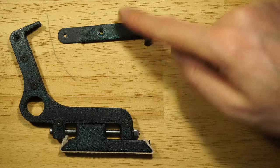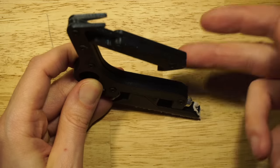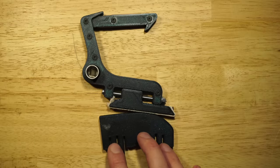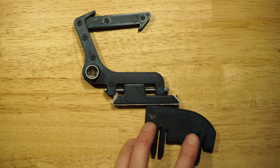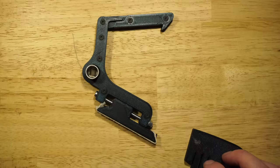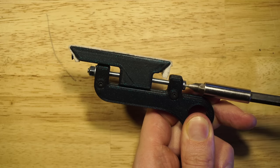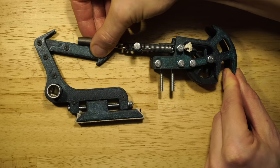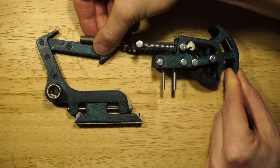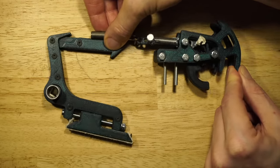The last part to assemble is this hook here, and then I can attach it to the top and it's pivoting really, really nicely. And then I can kind of demo here for you how the programming profile comes underneath and how the mechanics is working. And I can adjust the timing by screwing the adjustment bolt. And just for reference, I'm bringing in the marble gate here. So you can see that the reader is turning and opening the gate like so.